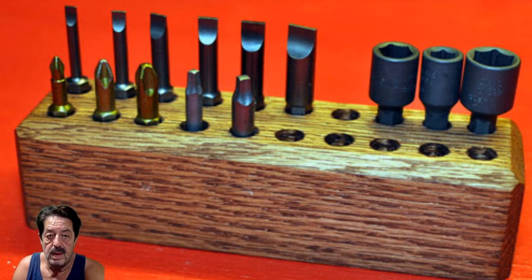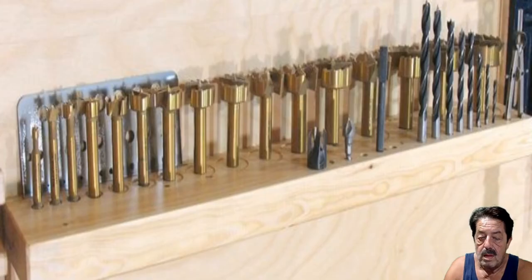If you really want to have some fun, sand it up real good, put some kind of finish on there. You can add a little bit of toning, stain it, let it dry, put a finish on — all kinds of things. You can see where you kind of 45 off the corners all the way around. I took a trim router and buzzed it around mine in about 30 seconds, sanded it, put a coat of stain I had laying around. It's fun just to play around with and finish them. You don't really need to do that, but it was fun.